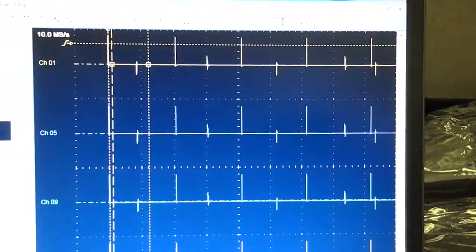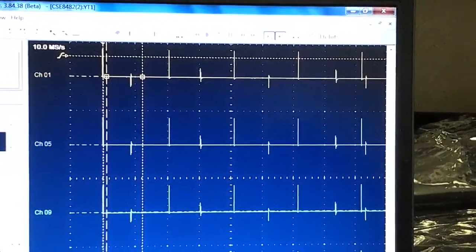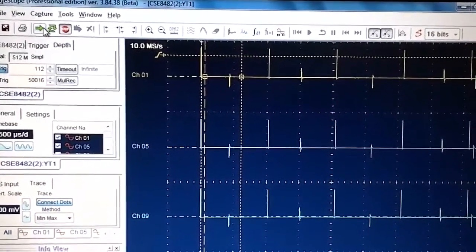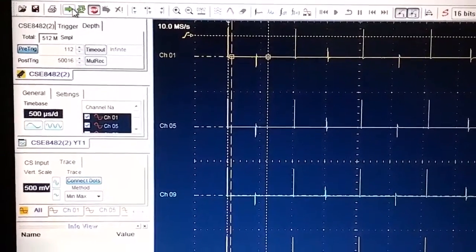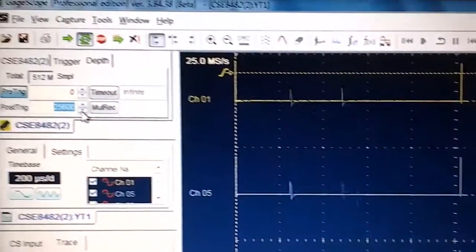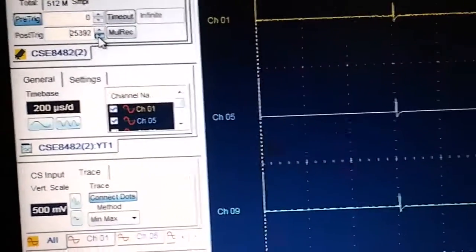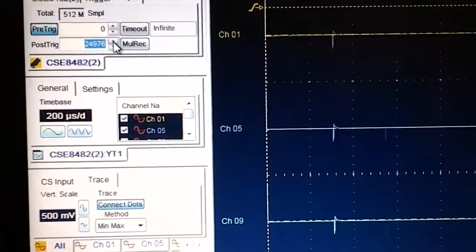Without persistence, we can see that the little trailing pulse flips its polarity every other time and moves to the right with each successive acquisition by 60 microseconds. Notice that the trigger pulses are about two divisions wide. Since we're on the 500 microsecond per division scale, this corresponds to a little more than one millisecond. We've backed off the number of points taken after each trigger to around 25,600 points, so that we just marginally see the next trigger. Backing the depth off to 25,000 leaves about 600 points, corresponding to about 25 microseconds — far more than the card needs to rearm itself.